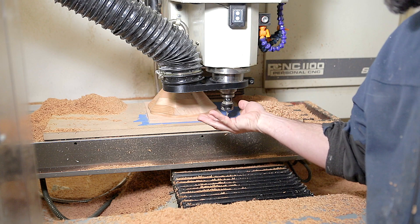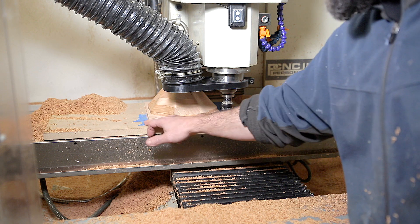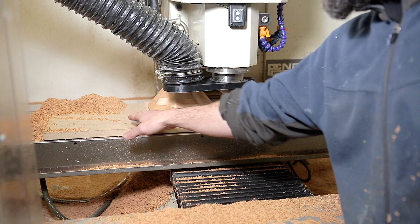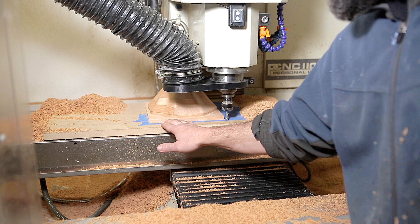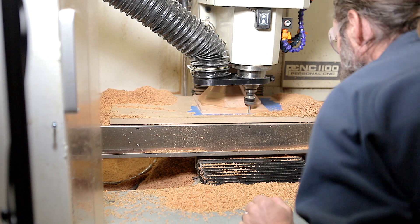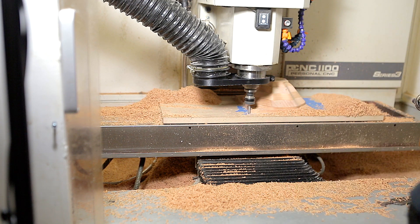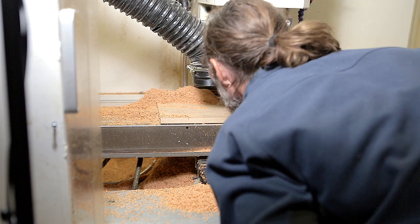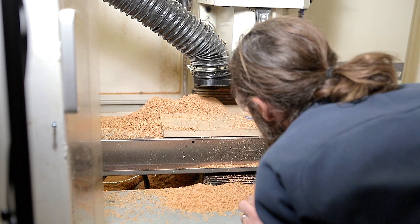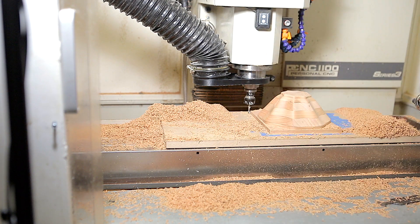I needed a way to indicate the bowl when I flip it back over. Since it's a little oversized, I milled it flat at zero on the Y-axis and then zero on the X-axis, so when I flip it over I'll have two axes to uniquely indicate it correctly. I just used manual jogging to mill the outer bottom edges. I did a G-code call of G1Y0 to get it to the right Y location, but then I realized this was a mistake and I milled off more than I should have — I should have gone to Y negative 0.125 for my 0.250-inch cutter diameter. This wasn't a big deal as I had plenty of extra stock and I compensated for the error after I flipped it over.